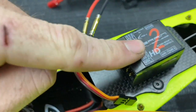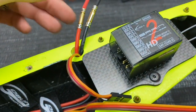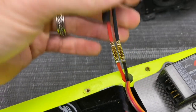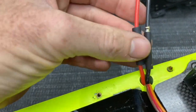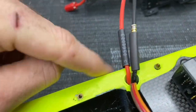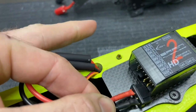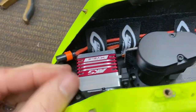I went ahead and placed the Brain 2 HD — we're running the HD for the separate power port. I soldered up some bullet connectors and now I'm about to put a piece of heat shrink over here and another piece over here. That'll secure those, run them back through that tube. That goes to our HD port which we'll plug into here and then pull the wire back this way. So we have our 2S power lead over here.